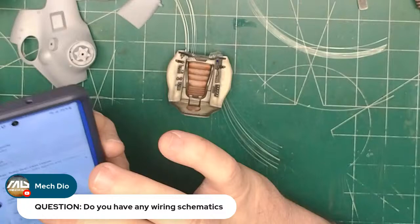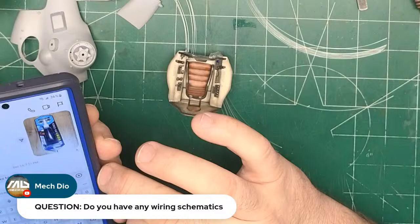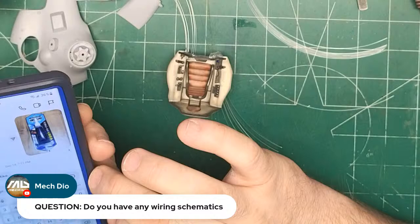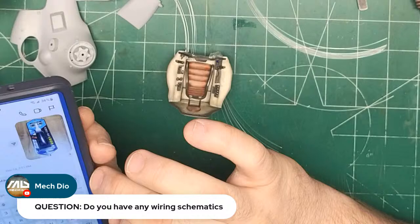So, to answer your question, David, yes, the diode voltage is going to be the spec of whatever that voltage is. And like I said, you can find those anywhere, an LED chart that'll show you what they run on. But really, red is the only one for some reason that needs a lower voltage, so you have to use higher resistors to run them. Everything else will run on 3 volts just fine and be happy without burning out.